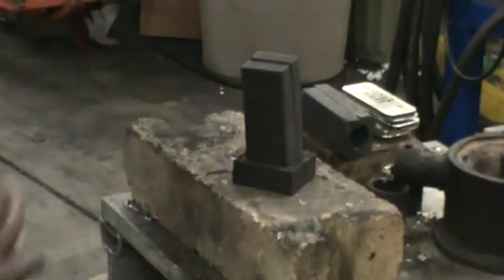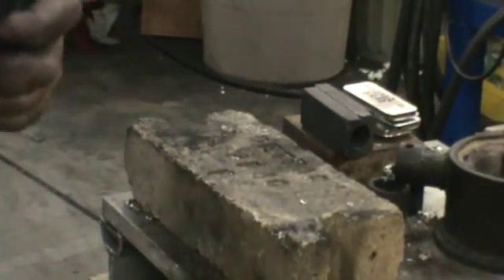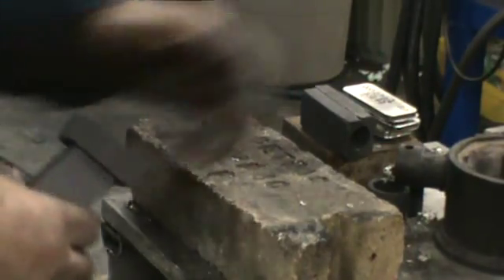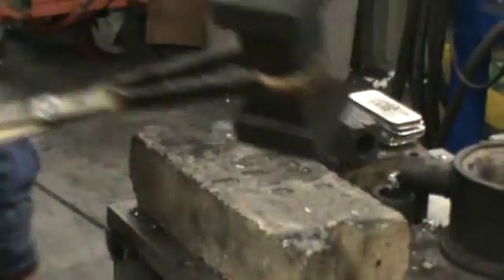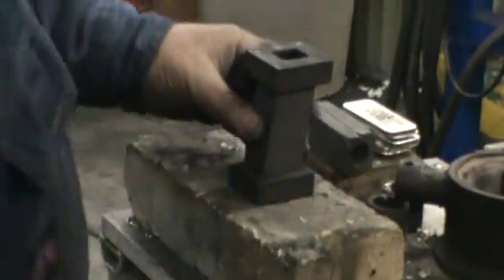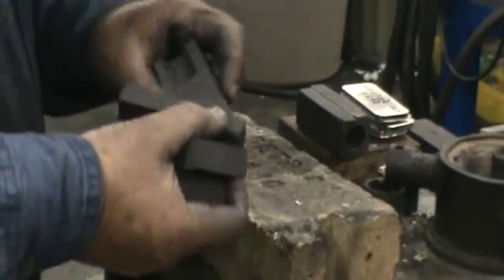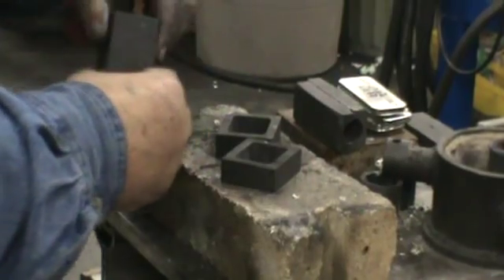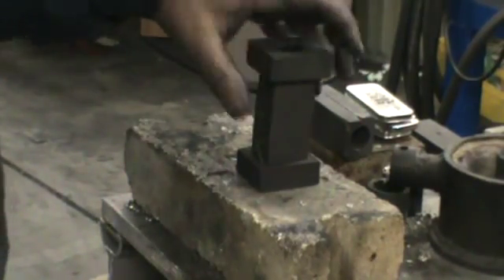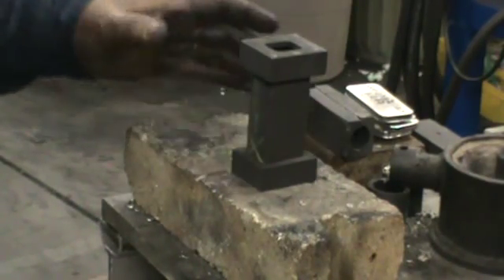Take the top one, knock it off, put that on there — just put that on top and they're ready to go. This really holds up well, and the fact that both graphite pieces expand the same because I used the same grade is key. You can pick it out with tongs when it's hot, right out of the furnace. It helps to grab it by the body, but I have lifted them by the top — you just run the risk of it falling out. I'm going to start making these for my vertical pour molds too, because this is just too simple. Set the bottom, set the top — just seating them will make them last plenty long.